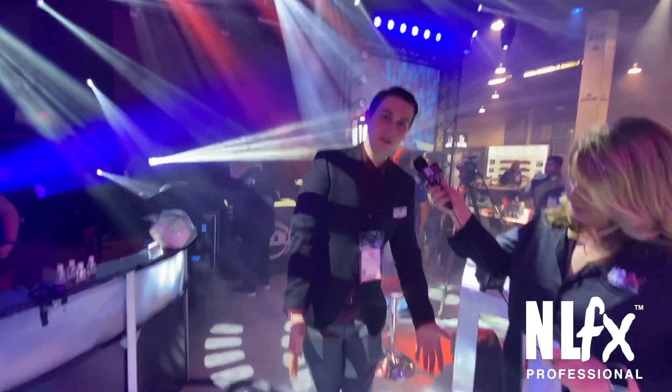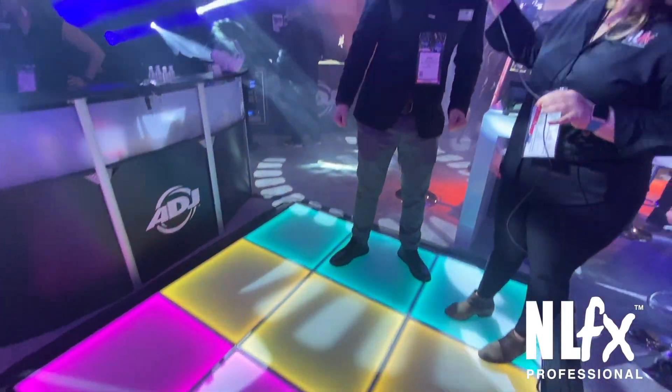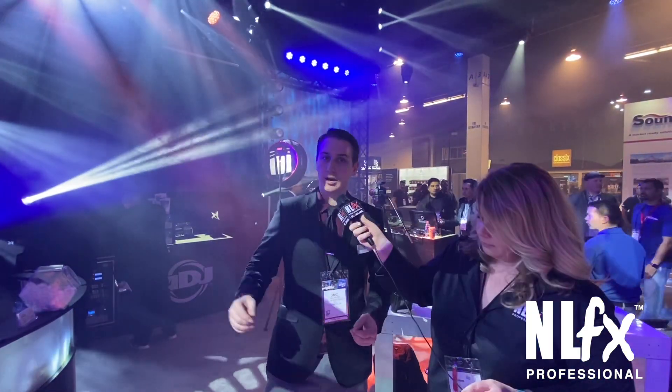So this is our MDF Dance Floor. First things off the bat, you will notice it is a color changing dance floor. It has RGB LEDs inside of it. They are individually controllable and DMXable. They also have multiple channel modes, all the way from regular RGB — 3 channel — all the way up to 10, which gives you lots of means of control.